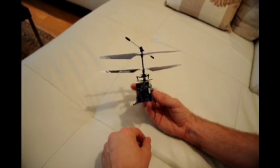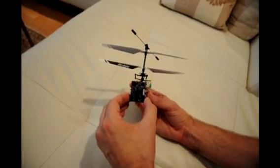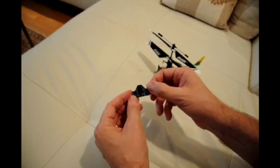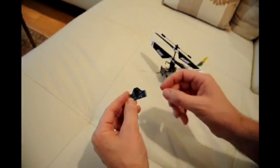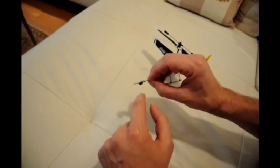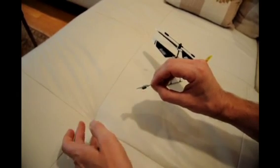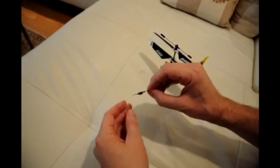The sensing is performed by what we call our processor board — this board which I'll connect right here — and this is where all of the vision processing is occurring. We have an Atmel AVR32 processor and a little sensor head plugged in here. The whole thing is quite thin. We have the two connected together using a board-to-board connector. There's no reason we can't put the two on the same board; we just did it this way for easy prototyping and checking.